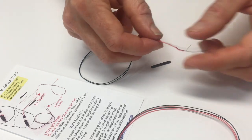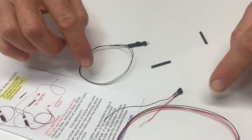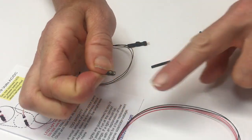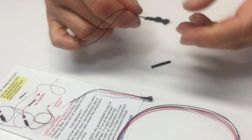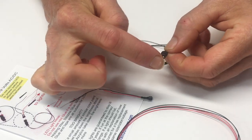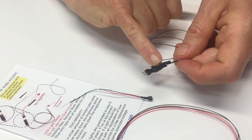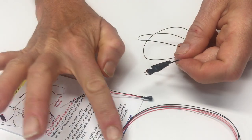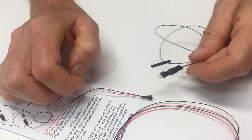This piece is a connector that goes to the lights. It has a socket type end — we call it a female end. This piece has the pins. It also has a bridge rectifier, a resistor, and a capacitor. It has everything you need to run these lights on 18 volt AC, DC, or DCC power.